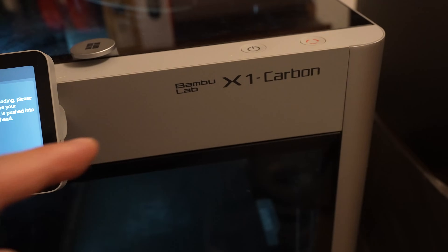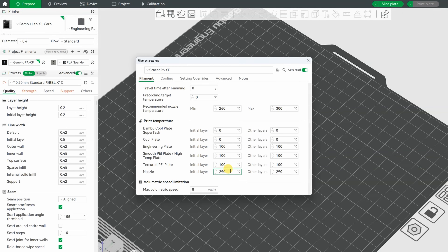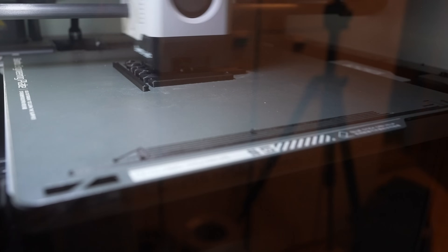Until then, the other filament gets additional drying. Printing is on the X1 Carbon, using an engineering plate with some glue on it. For slicer settings, I'm starting from generic PACF and changing the temperature to 280 degrees Celsius, with maximum flow set to 8 and default part cooling. My typical test objects — I'm quite sure this printing will be fine. I'm printing all test objects at once at the highest recommended print temperature, and later I will print some test objects for the annealing.